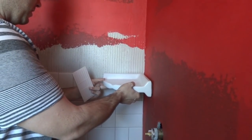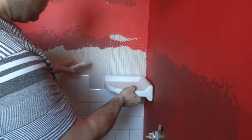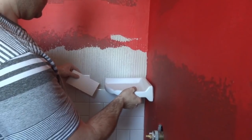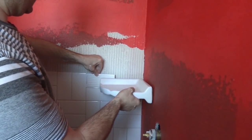To make it simple, I'll figure out exactly where this lines up and then hold the tile up in place. I want to flip it around so the back is facing out, and then run a marker on the back side of the tile to mark the shape I need to cut.